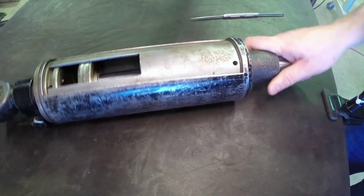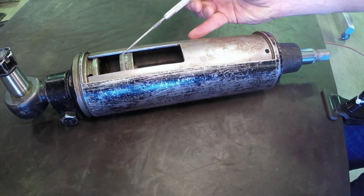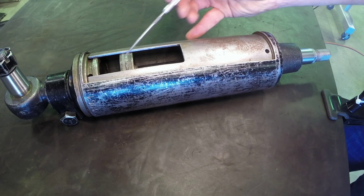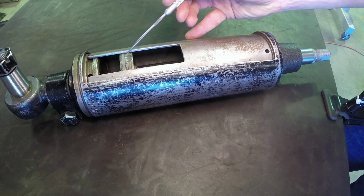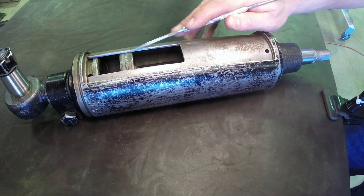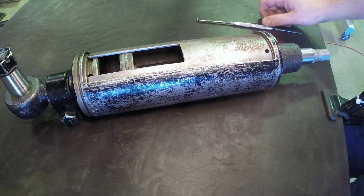High pressure steel rings are used as pressure seals on the piston. Alternatively, these could be lip seals facing opposite directions for double acting operation, or an o-ring with a backing ring on each side — installed so that incoming pressure pushes the o-ring into the backing ring.